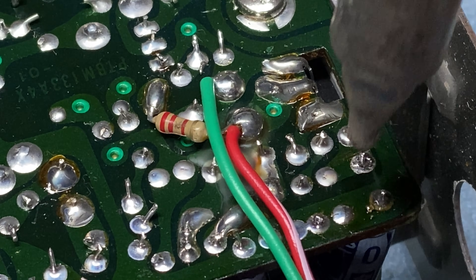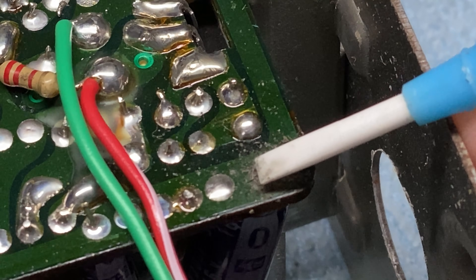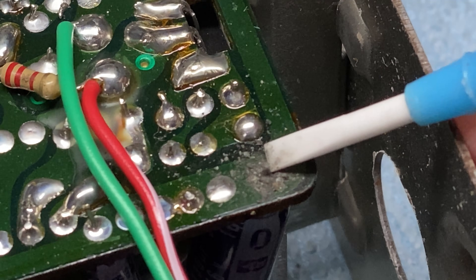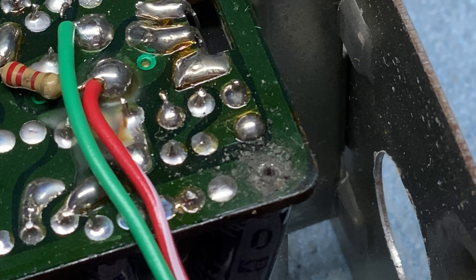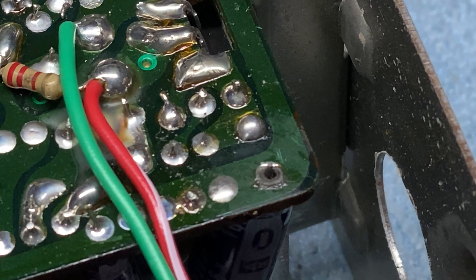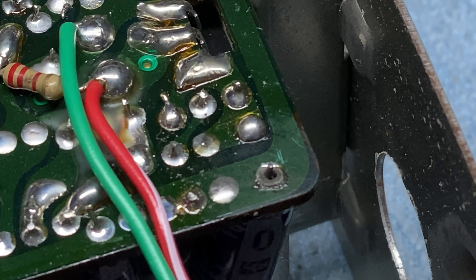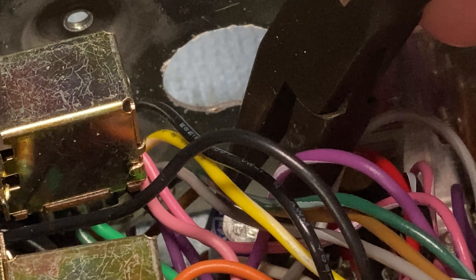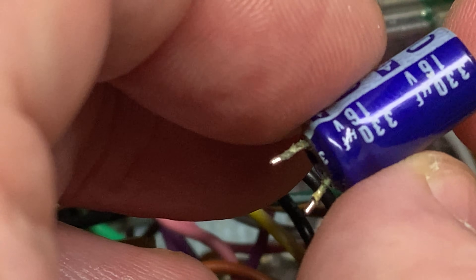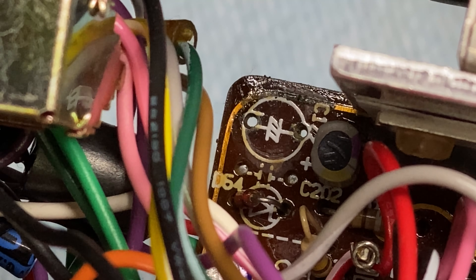This has definitely got to be the most interesting one I've seen like this. I just started to scrape away and you can see all the solder — it's just turning to dust. The leg of the capacitor is just flapping about in the breeze. We'll clean it off with a little bit of IPA and we can see that the juices from the capacitor have eaten the solder away quite badly. Let's take the capacitor out and have a look — yes it's definitely been leaking. That's definitely not going to help matters, and I reckon the trace is gone.